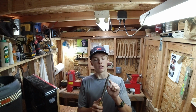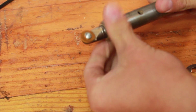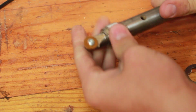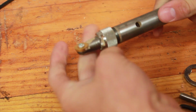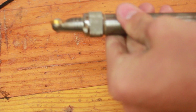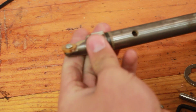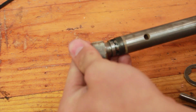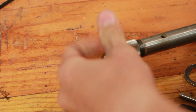So moving down, we have the cutter interchange quick lock system. I don't know what you want to call it, but the benefit of this is it allows you to do shearing cuts while not having to rotate the tool at all. You just keep it on the flat portion, and the head actually rotates to 45 degrees right or left, and it can also be used at just a standard 90 degrees. The 45 degrees are meant for shearing cuts, great for the inside of the bowls, and it takes a little bit to get used to on the outside of bowls and spindles, but it's great for the inside of bowls and it keeps it nice and smooth.